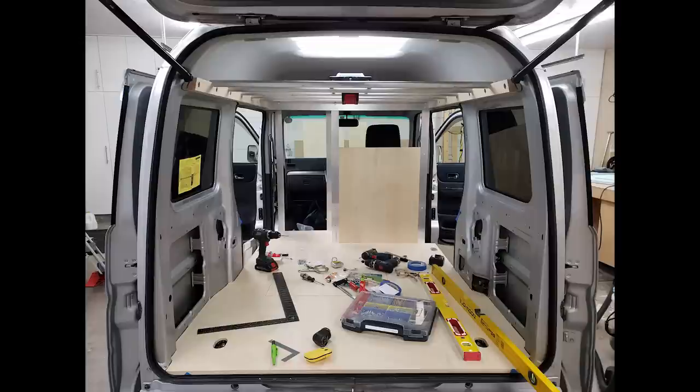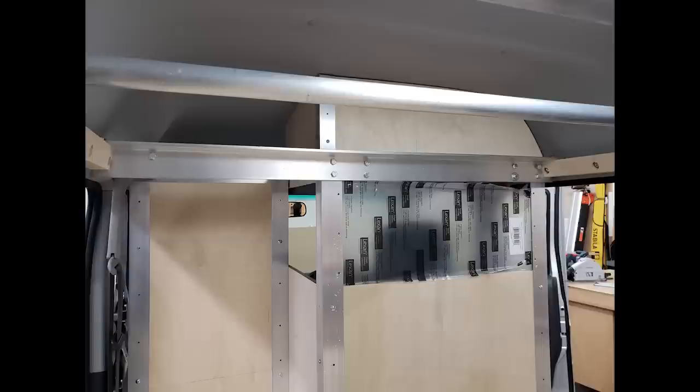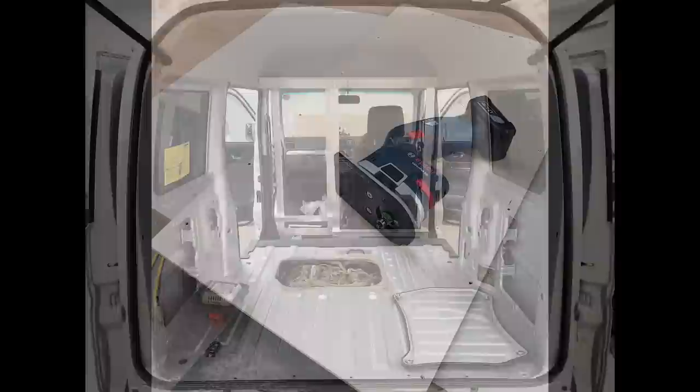With the cardboard mock-up panels removed, I started fitting the divider with Baltic birch panels. To make the panel at the ceiling, I created a cardboard template to get the shape just right. With all the Baltic birch panels made and fitted in the divider, I cut and fitted a piece of lexan to make the window behind the driver's seat. The Baltic birch panels and lexan were all fastened with 8-32 machine screws, washers, and nuts that went through the aluminum framing. At that point, I removed all of the wooden components, rounded over the sharp edges, and gave everything a good sand. I set up all of the components upstairs in the shop and applied three coats of acrylic finish to protect them.